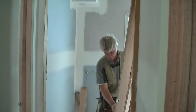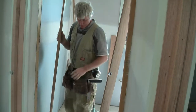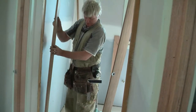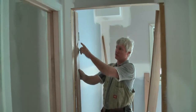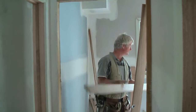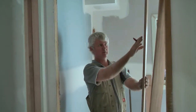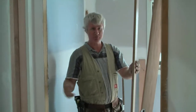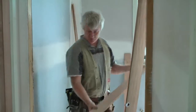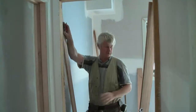There are our door stops, which we'll use later. To make sure we end up hinging it the right way, you stand one jamb in place, make sure your hinges are on the right-hand side, and mark the top. Because if you spin it over the other way, the hinges end up on the wrong side — that would be a left-hand hinge. So when cutting the styles or jamb, we must not get the top and bottom mixed up. Stand it in the opening, make sure it's the right way, mark it 'top'.